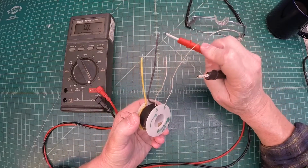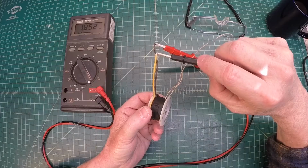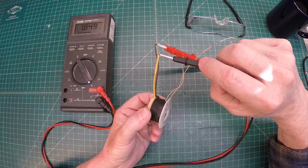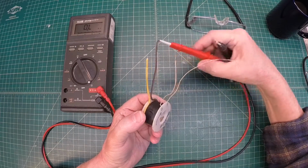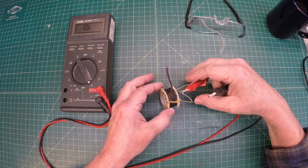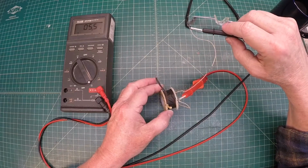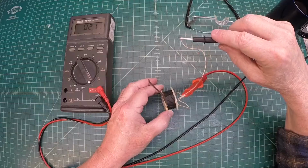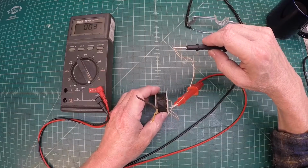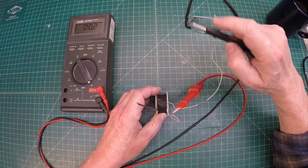Let's check the DC resistance again. And looking good. 1.849K, so 1849 ohms. And the humbucking coil here, you guys recall, 85 inches of wire or so, 24 AWG, so probably somewhere around 0.1, 0.2 ohms. See the meter moving back and forth.